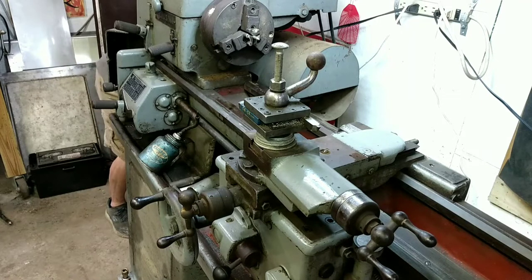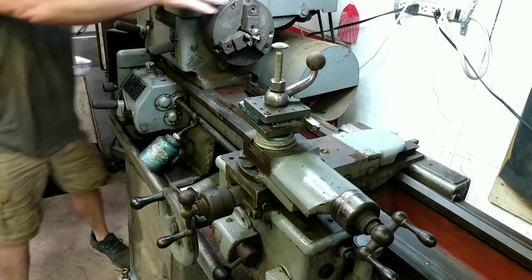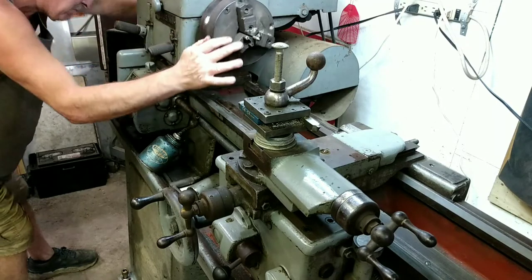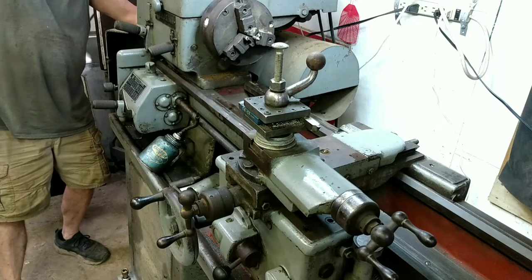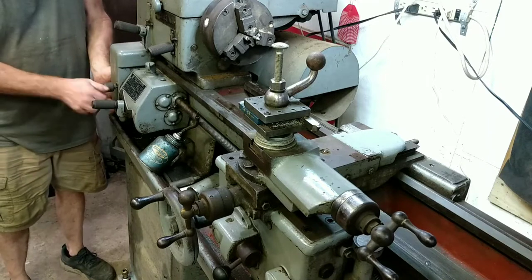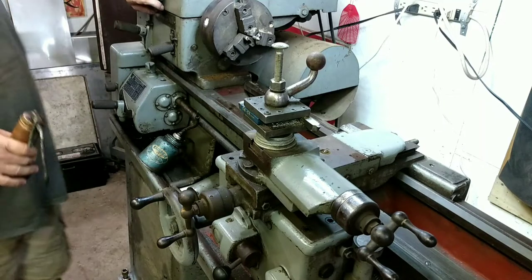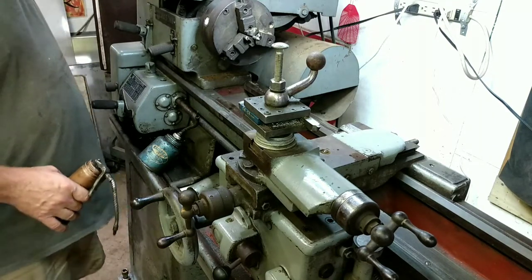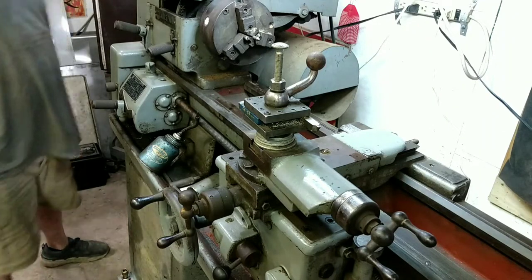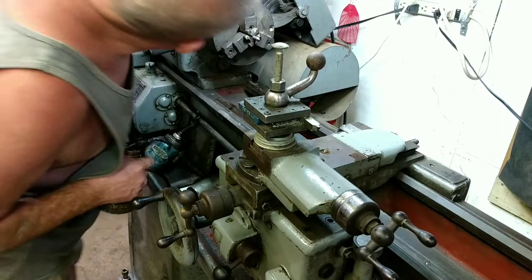I do not have one. So I'm going to change this fraction around a little bit, but I'm not changing the value of it. All of these equal one another. So I can change the 1 15/25 to 1 3/5. Well, it doesn't do me any good. I'll multiply the top and the bottom times 3 now. That gives 1 9/15. And that's why I want a circle with 15 holes.